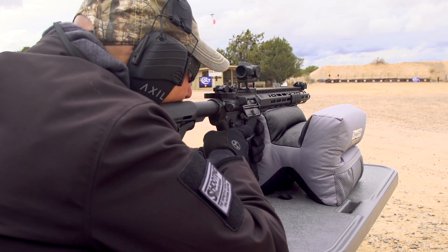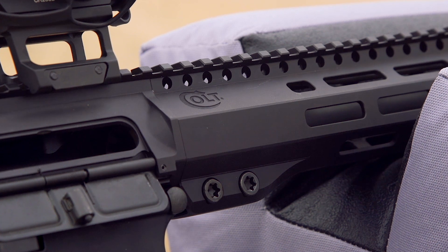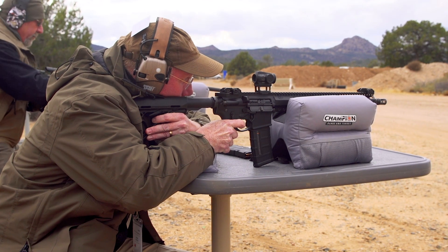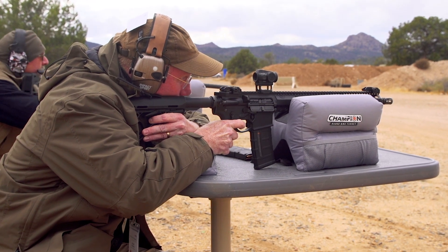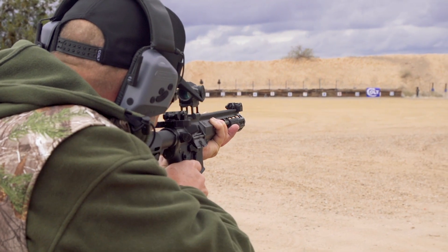As well as a really unique upper receiver design. What we would say is it's a true free-float design. The upper receiver itself attaches to the handguard, not to the barrel nut. The barrel nut is ID threaded into the upper receiver in a way that doesn't interface at all with the handguard — which is really cool because you don't realize how much harshness and heat are transmitted through that handguard because it's hanging onto the barrel nut.